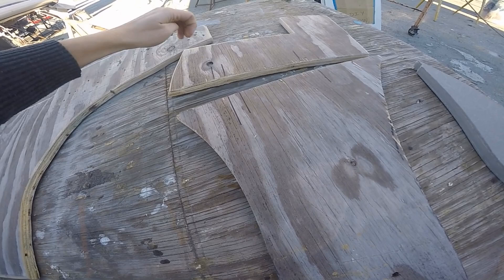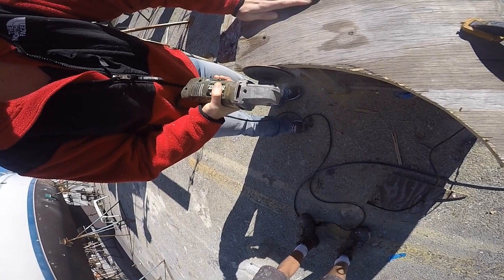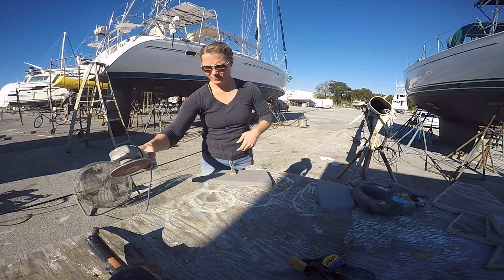While the templates were very close, a couple of them needed a little bit of shaving. Why they trusted Video Annie with the power tool to do this, I can't tell you. But once we had them seated snugly, it was time to break out the hardcore material — Coosa. We were going back with high density foam. It's essentially fiberglass and foam, real fun to cut. But soon we had our first stringer in.